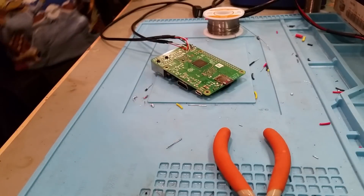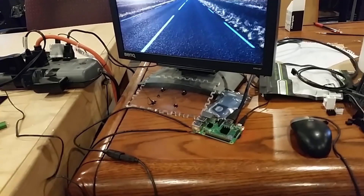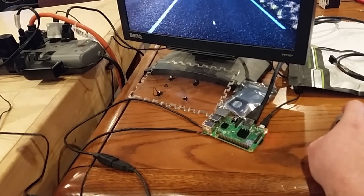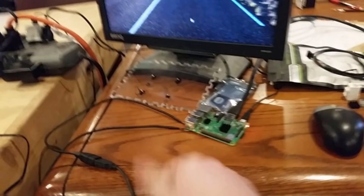Here's the pinout on the USB ports themselves. On the left is a standard USB port — you can see pin one is plus five volts, then two data pins, then ground. On the right is the motherboard header, which we're taking apart. All of this maps out the way you'd expect, no real surprises. We've got the pins mapped out — plugged it in, and the mouse still works. Making the assumption it's wired correctly works just fine.